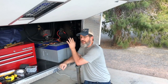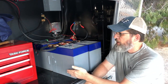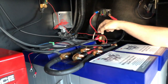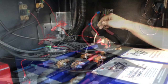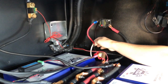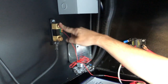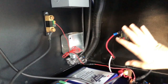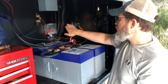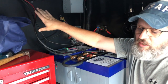This is the underneath storage — we placed the four batteries here. All I have to do is build a frame so they don't move around while we're traveling. They're all wired together. This is the 60 amp fuse for the solar panels coming from the charge controller. I also installed a 100 amp circuit breaker here for the connections into the actual coach for the stuff that runs off 12 volt. I do have the battery monitor mounted here — don't have it all the way hooked up yet. We also were able to fit the circuit breaker, and the Victron inverter charger is going to mount on this back wall once we get to that step.